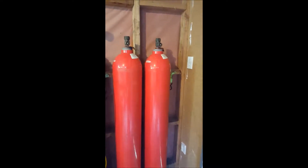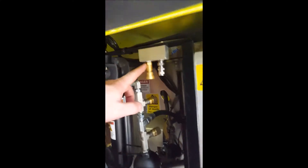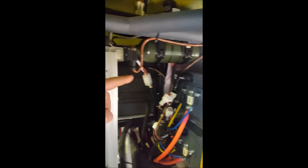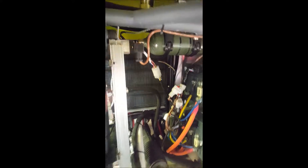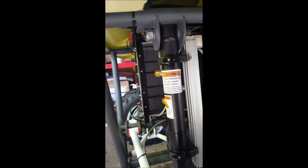The first thing to tell you about is nitrogen. The fuel cell uses nitrogen — this is the filling connector, this is a bleed connector — and this allows me to fill this accumulator over here with high-pressure nitrogen gas. What that does is, at the start of fuel cell operation, it purges the fuel cell.